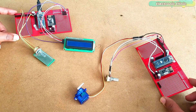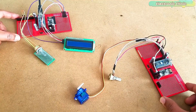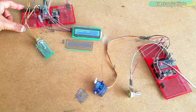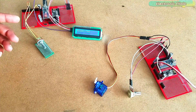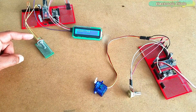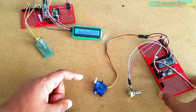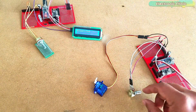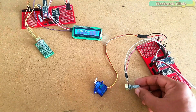I will use the same circuits from my previous tutorial — I have already explained the PCB designing and soldering. I started with only two NRF24L01 modules. This is the base node 00, to which an I2C-supported 16x2 LCD is connected. I have also connected a potentiometer, which I will use to control a servo motor connected with sensor node 01. Node 01 also has a potentiometer whose value I will send to node 00 and display on the 16x2 LCD module.